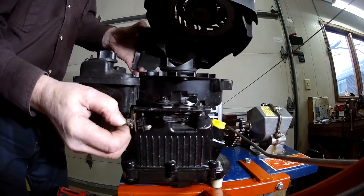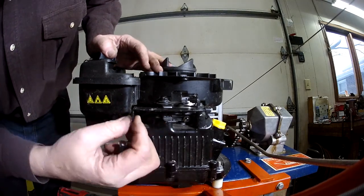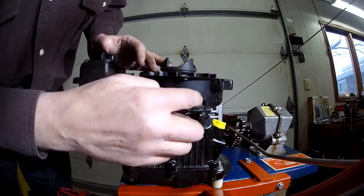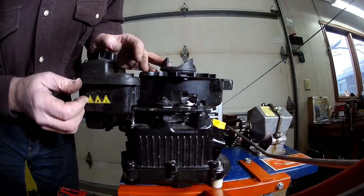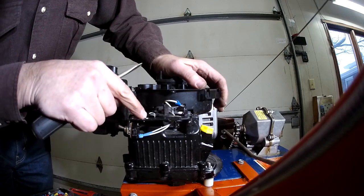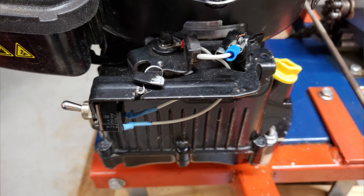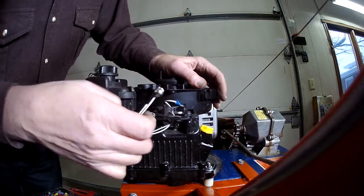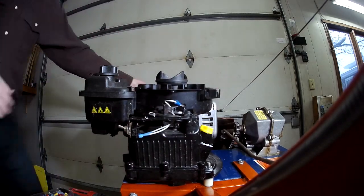This is sort of a MacGyvering process. It would be nice if that were a continuous piece of metal, but it'll work out. I'll take a file and clean up that burr just a little bit, pull some wires out, extend a wire, put a ground in, wire up the switch, and mount it up here. It took about 15 minutes. My little switch is mounted in here, all burred and cleaned up. A little piece of safety wire right here to tie this brake mechanism in place so it's not buzzing around. I ran the wires around the backside - got terminals that slide right on, and a clip that slides on that terminal. The ground connection is tucked away in there under the bolt, nice and tight. When we put the cover back on, that looks pretty good - looks like it belongs there.